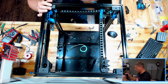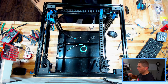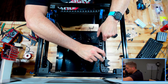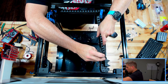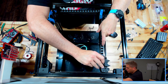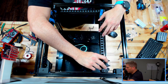Once I get the afterburner and drag chains mounted, I'm going to run my wiring, pull it to length, crimp my ends, then lay it in. One important tip: these drag chains open on the underside — the tops do not open. So if you mount your drag chains before putting your wiring in, you won't be able to thread the wiring through. That's why mine aren't attached yet — you need to run the wiring first.